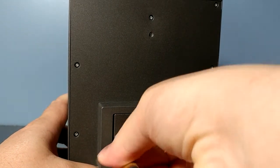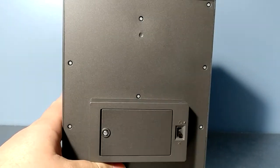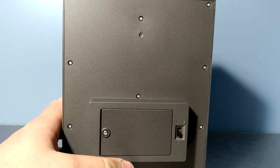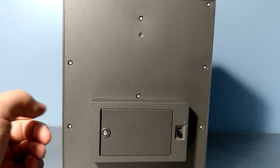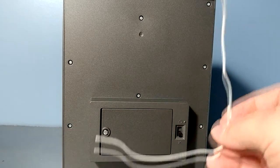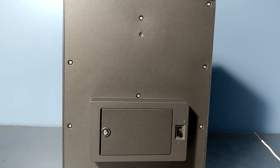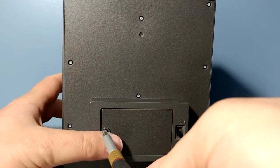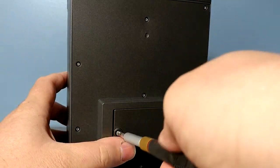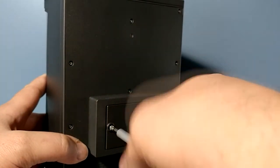First you've got to undo this — of course this is just a battery cover, you just need a screwdriver. We're also gonna need some wire; speaker wire will do fine, any small gauge wire like this is fine. Just need a pair of these for each one. I'm gonna wire mine in series with the other three so they all run on one plug. For that we're gonna need a power supply. What kind of power supply you need will depend on how many of these you're gonna wire up.